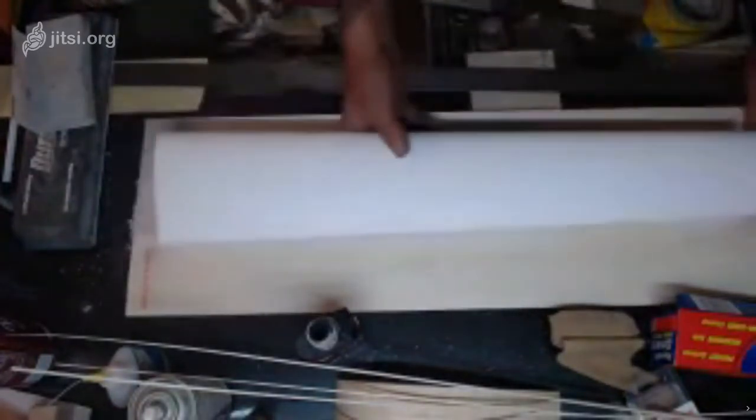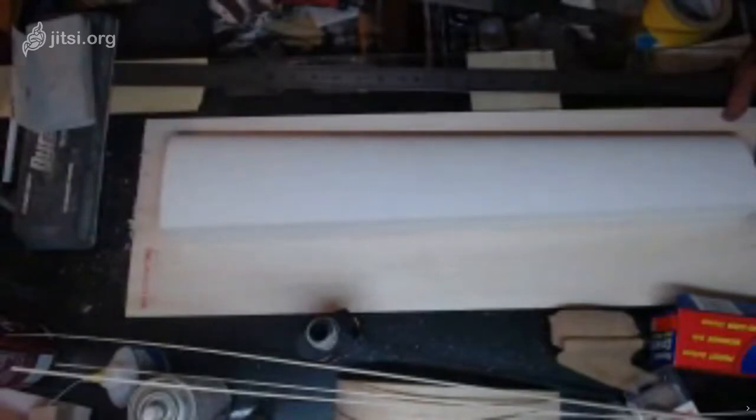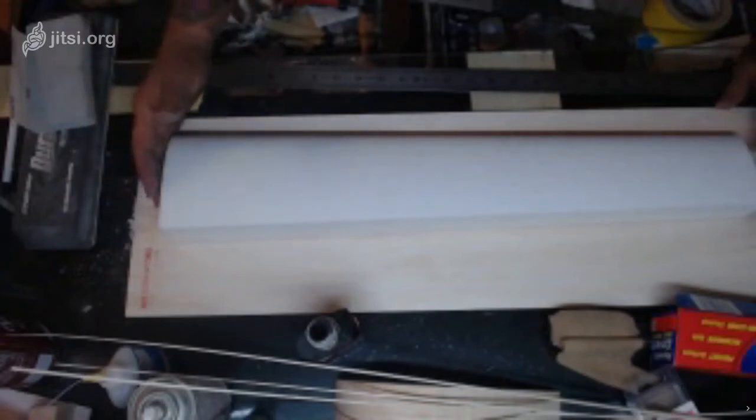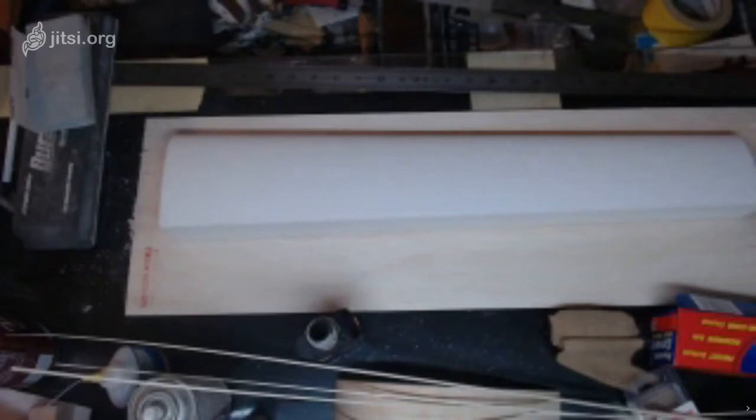Okay, this is an experimental wing build. And this particular buck is cut to the exact length. Well, what that comes from is not thinking things out. It needs to be at least a 1/4 inch longer so that I can have an 1/8 inch center rib and a 1/16 inch tip rib with some left over to block sand square. So we're just going to add that and let it hang over. So that's kind of the important part about thinking things through.